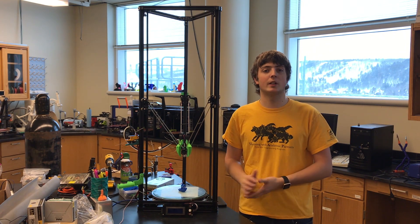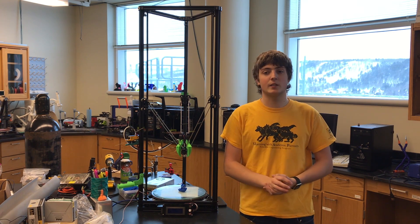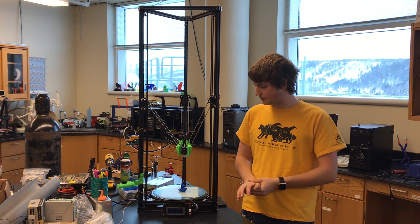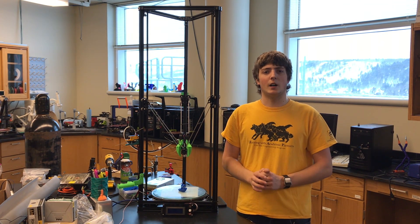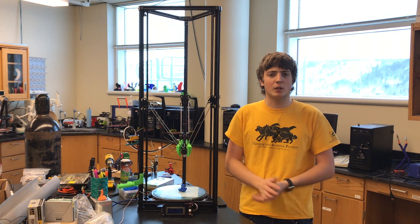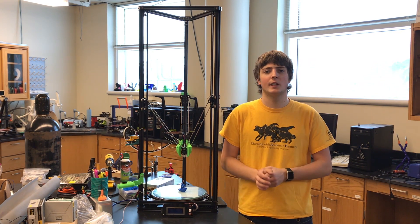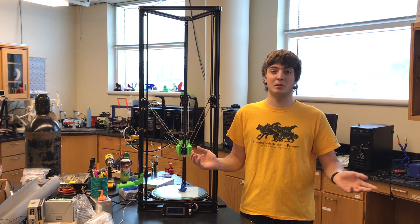The actual motherboard of this printer is the MakerBase MKS Gen L, which is a really nice motherboard — I believe it's 8-bit, so it runs Marlin. It did ship with Repetier firmware, but I was not able to get it to print nicely with that, and I knew Marlin better, so I made my own Marlin configuration, uploaded it, and now my printer works fine — I was able to get it printing within 5 minutes after building it.